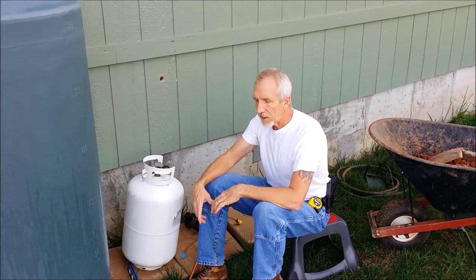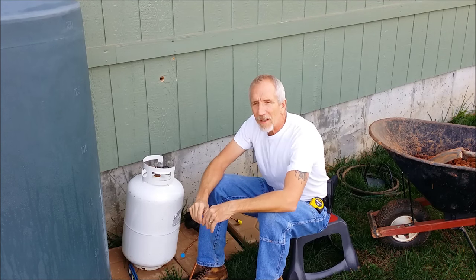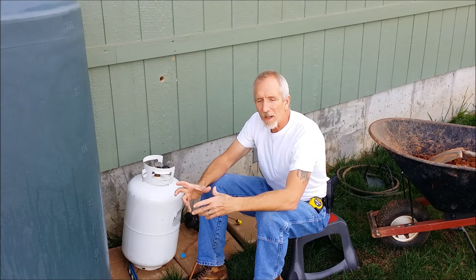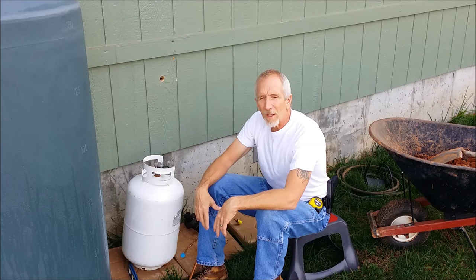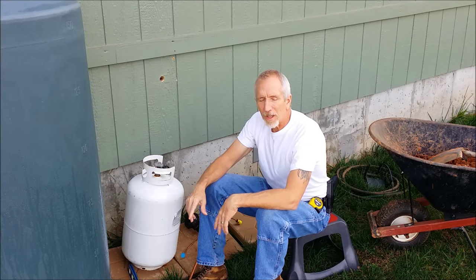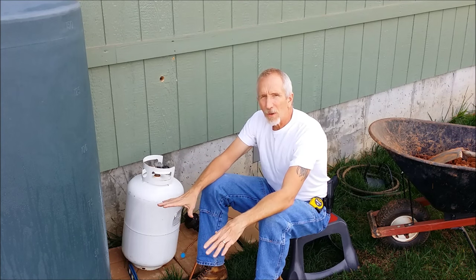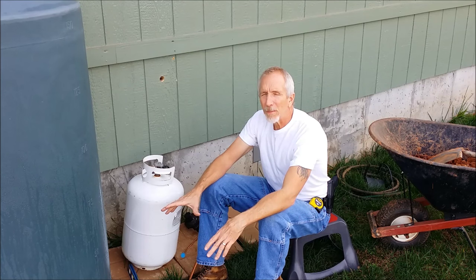An interesting thing about wanting to hook up a gas stove: originally I had ordered a stove that had all the fancy glow coils for igniting the burners, fans, timers, and all that — but we didn't want any of that, we just wanted something simple. What I found out is those stoves will not run without electricity. The stove burners will, but the oven won't, and they also pull a lot of power. So if you were trying to hook it up to solar, you'd kind of be defeating the purpose.